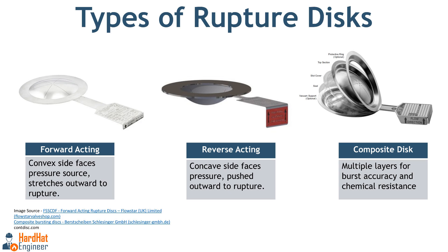Types and material of rupture disc. Rupture disc comes in three designs: forward acting, reverse acting and composite disc. Here in the first image you can see the traditional disc. A forward acting rupture disc works by placing the convex dome-shaped side of the disc facing the pressure source. As pressure increases, the disc material is stretched outward until it reaches its predetermined burst point. Once the pressure exceeds the disc's rated capacity, the disc ruptures along its weakest point, allowing the excess pressure to be released safely. The pattern on the disc improves the disc bursting profile. This design is typically more cost effective and is commonly used for applications where the risk of corrosion or high temperatures is not a major concern.